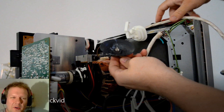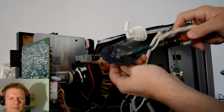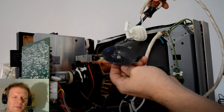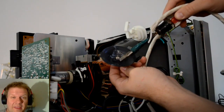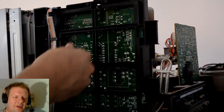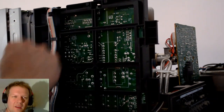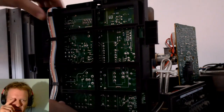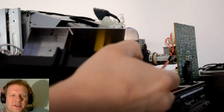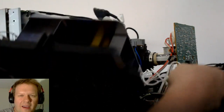Obviously you do not want to touch any of that metal with your fingers - this is a slightly more dangerous method because there could be live current on it. So what I do is discharge the anode cap and then discharge the tube with my discharge tool. That's technically the recommended way that Sony not only says to do in the manual, but in training as well. Every CRT and Trinitron tube - you'll find in the manuals that's how Sony recommends you discharge it.